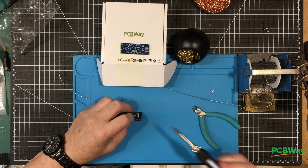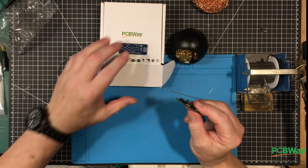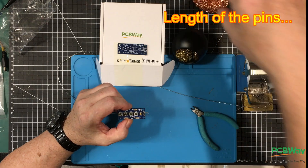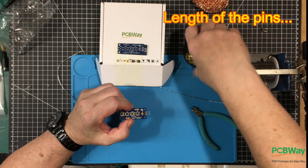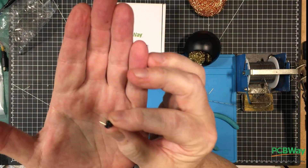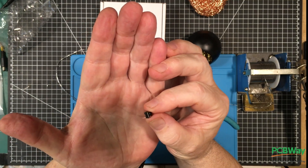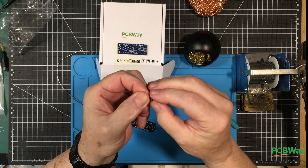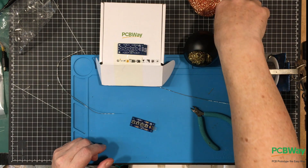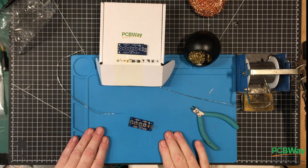Another thing I wanted to show you — a lot of people use the ones I put in here, these little tactile switches. A lot of people use these on breadboards, but the legs on them are very, very short. The ones I use on breadboards are these ones here — they've only got two wires on them and they're really nice and long. These are so much better in breadboards. For breadboarding, this is the way to go rather than the four-pin ones. Let me get things arranged and we'll come back and test this keyboard.